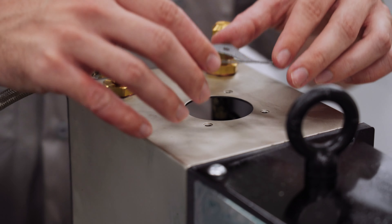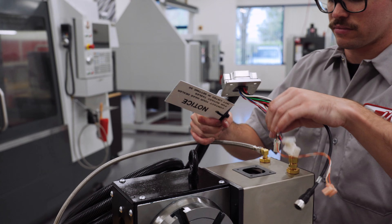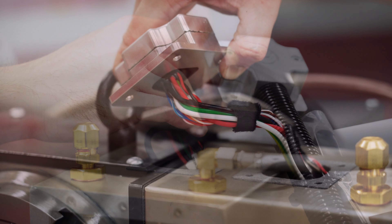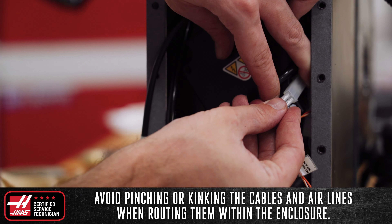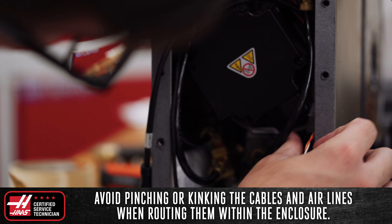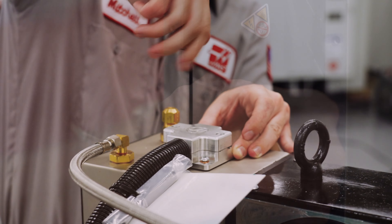Next, align the new J-box gasket using the four holes and attach it to either the cover plate or enclosure depending on the location of the J-box. Route the cables through the opening but do not fasten down the new J-box yet. Using one of the cable wraps you saved, wrap the J-box cables together approximately two inches from the J-box. Attach the cables together, ensuring they are properly connected and routed within the enclosure, avoiding pinching or kinking. Once all cables have been properly routed, use the remaining cable ties to organize the cables and fasten down the J-box.